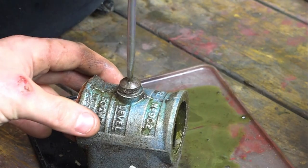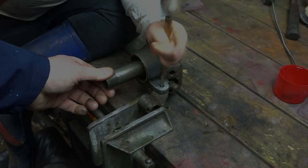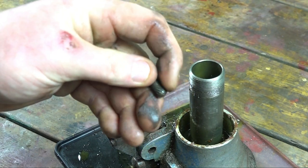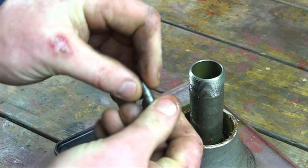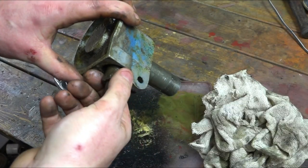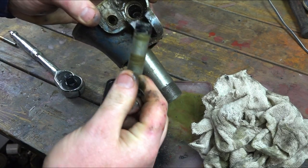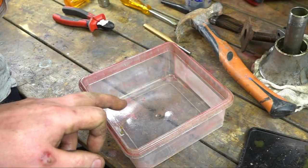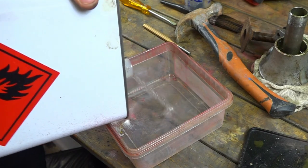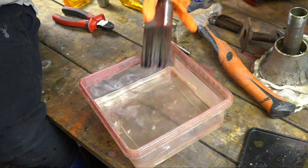We'll give that a clean up. This is the fill hole on the side. We've taken that out, clean that up, make it look shiny. So this is the pin - it's got a little bit of rough edge there, and that rough edge actually holds it in, on the old stuff, before they started making stuff cheap. That's how they did it, and there is the retainer that holds it in. Now I'm going to put some thinners in there because it's full of oil - thinners is the best thing to get oil off. If you sandblast with something oily it makes the glass stick together so it won't work.